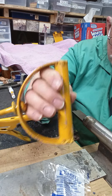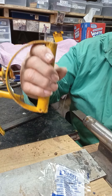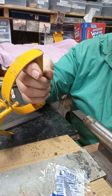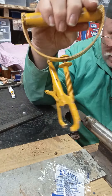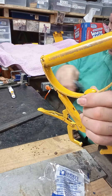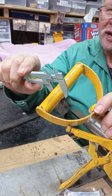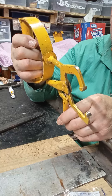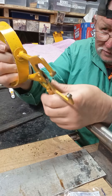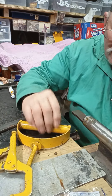Now all this is is one-eighth by one flat bar, and that's a piece of three-quarter inch — I think that's EMT, either that or half-inch rigid, I don't remember. That's seven-eighths of an inch, so that's probably three-quarter EMT. And that's just one of those little Harbor Freight clamps, with a three-eighths bolt, round top.